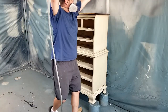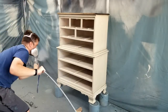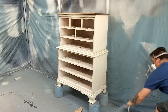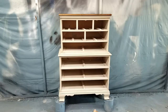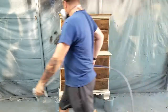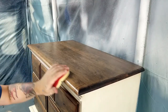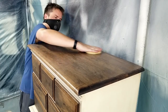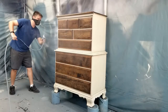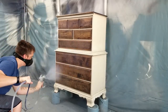After I'm done with the glazing I let it dry for about an hour, then I'm ready to topcoat. I'm using the same Graco airless sprayer and I'm spraying water-based polyurethane. This is a super fast process, especially when it's hot like today. I apply three thin coats, then come back with some 320 grit sandpaper to knock down any rough spots. For my last coat I spray a much thicker coat, which gives me a glass-like finish. On a day like this where it's over 100 degrees, I can topcoat a piece in a little under an hour.